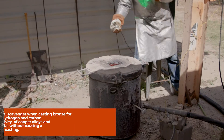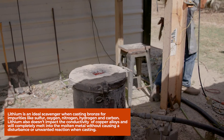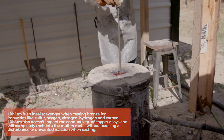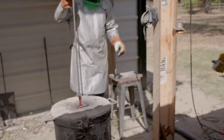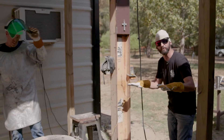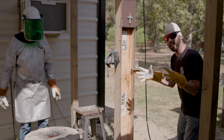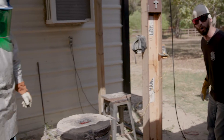Right now we're adding lithium and a bit of glass to the pot. The lithium sinks to the bottom of the molten metal, then rises back up and pushes all the impurities to the top. Then we add glass on top — like dropping in a bottle of vodka — which forms a protective coating similar to slag, catching all those impurities so that we have a nice clean bronze to pour.